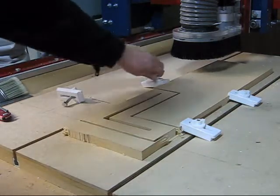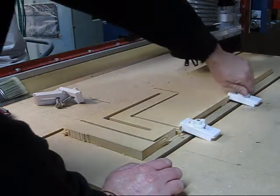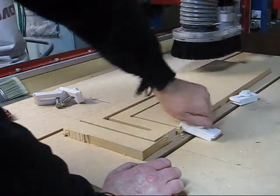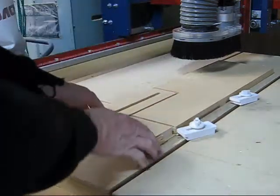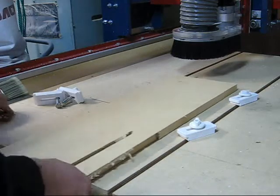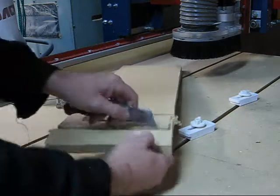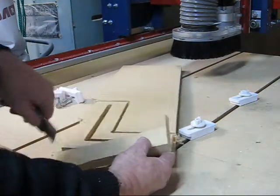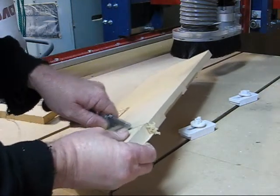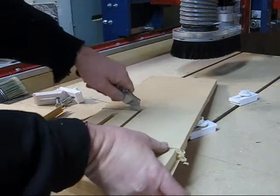All out, the cut is finished. Just releasing it from the table. As you can see there, the slot is cut all the way through — just the merest paper-thin piece left on there. And now with a simple knife, it's just a matter of cutting off that half millimeter of MDF that was left holding it. We can easily deal with that once we've got the part free.